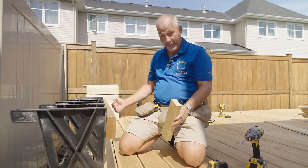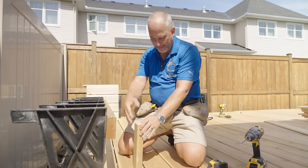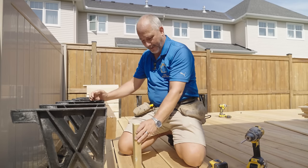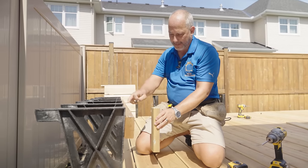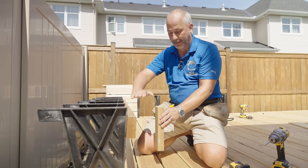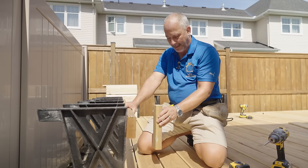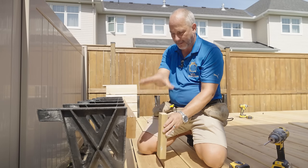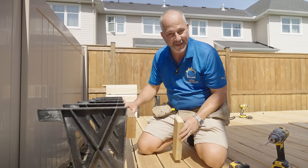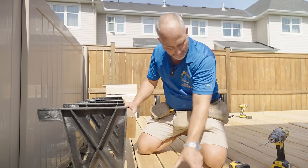Now remember, we're doing all the horizontal boards. So in my build out, I need horizontal bars where all these seat brackets are, okay? So I want to bring this up to the same height as this, and then have a 2x4 come across to carry this load, transfer it into this, and that's gonna work out fine. So I'm just gonna make a series of L's to sit in place, and then we'll start screwing the faceboards on. That's gonna be super fast.